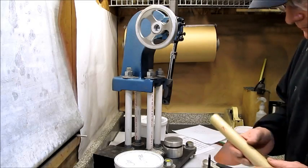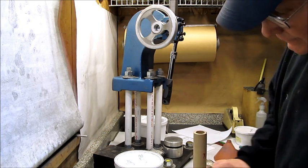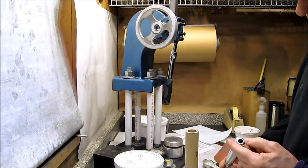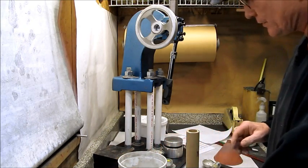I'll put my tube on the spindle in the right direction with the mark showing where the tip of the spindle is going to be on the side of the tube. My hollow first rammer — the nozzle-forming rammer — has a paper tube up inside it to center the tip of the spindle inside the tube when it's pressed.